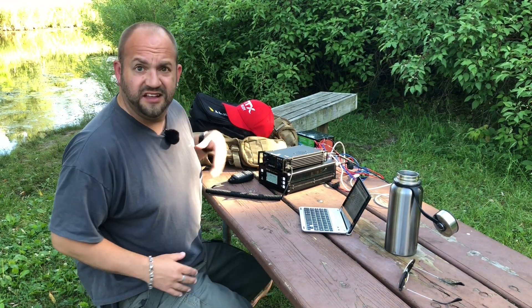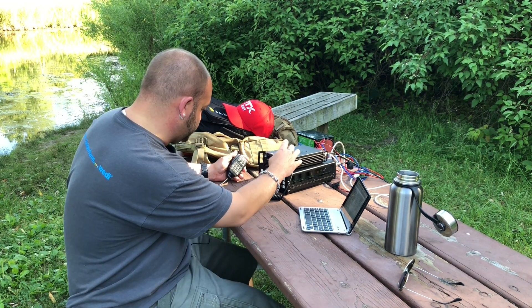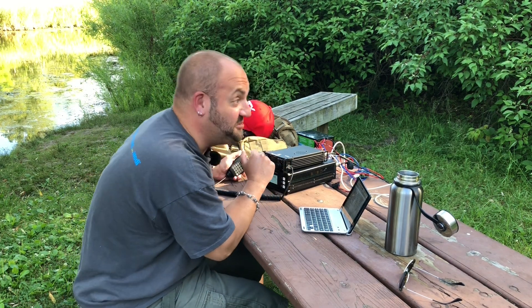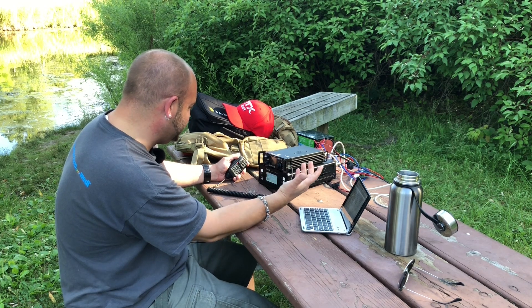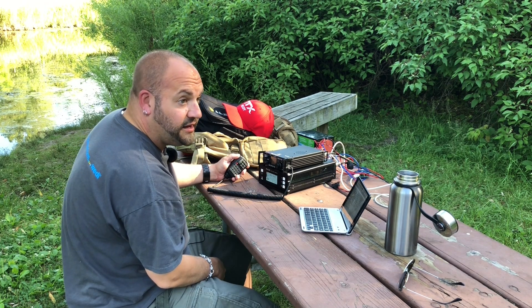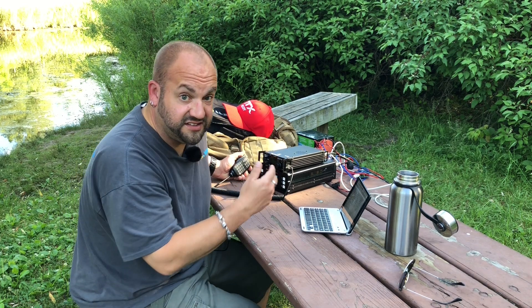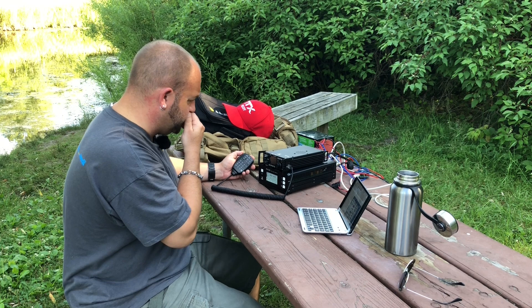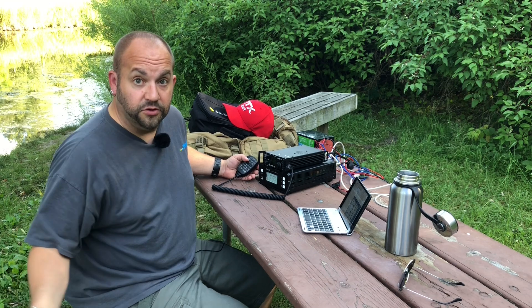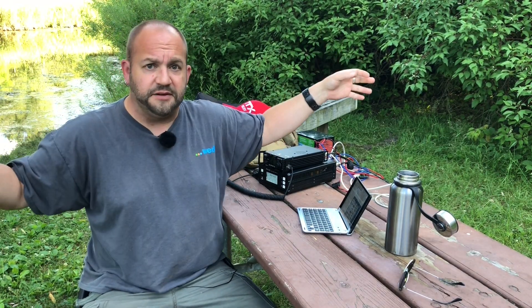Just for giggles — will it tune the Pac-10 Mini on 160 meters? Yes, it will — putting out 93 watts. That's crazy. 83 watts on 80 meters. Let's try 40 — I hope we don't melt the antenna. 81 on 40, 96 on 30 meters, 97 on 17 meters, 98 on 15 meters. For some reason the amp doesn't recognize 10 or 12 meters from the radio, but it still tunes just fine — 92 watts on 10 meters. Everything tunes. Probably a setting issue with 12 meters, but whatever, it works. With the G90 and the Pac-10 Mini, it tunes up everything.